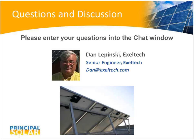Well, okay, great. I had another question that came in about noises. What's the noise level increase in decibels caused by having several inverters on each panel versus a single DC string system? Well, the DC string system is only going to be noisy if you've got a fan or other mechanical device moving it. Sometimes they do hum or buzz hanging there on the wall. The AC modules being mounted on the PV, first of all, are going to be outdoors and completely away from everything. And number two, they're silent anyway. You can't hear them. There's nothing to vibrate. There's no moving parts. It's all convectively cooled.